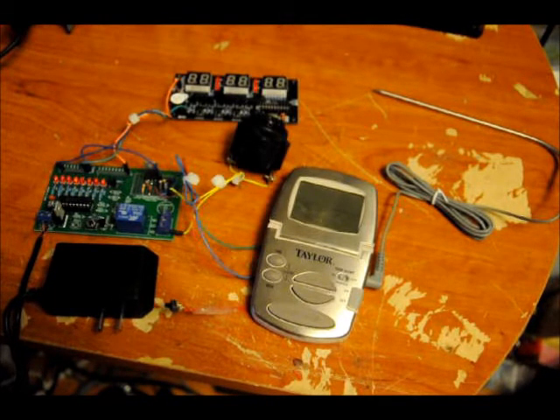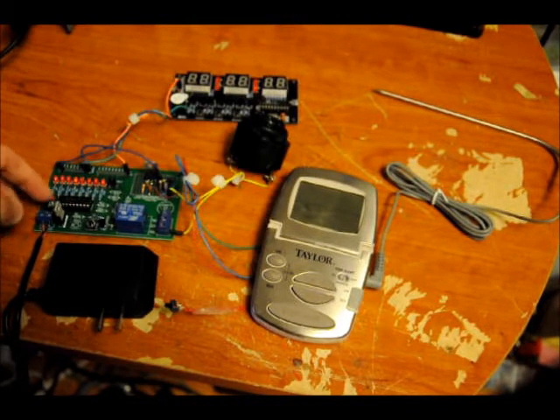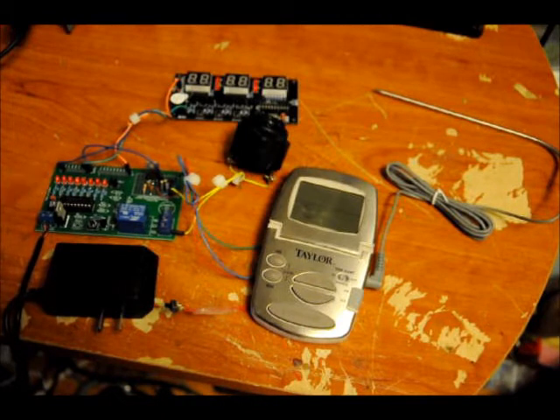When the device is stable, there's about 1.25 volts on the buzzer, and when the alarm goes off it's about 2.5 volts. That's obviously not a digital input, so what I had to do is put that signal line onto an analog-to-digital port on one of the I/O ports of the PIC18F. Basically it says, if the voltage is between these two voltage levels, set off the alarm. So let me just give you a demonstration.